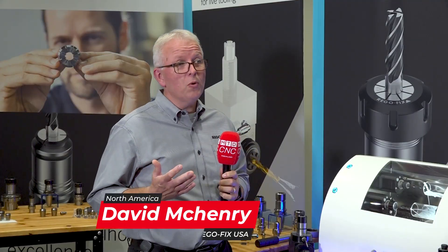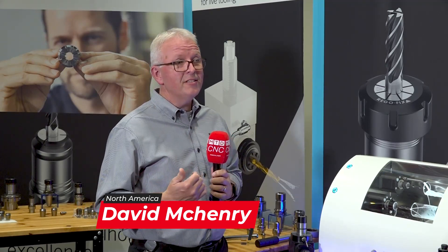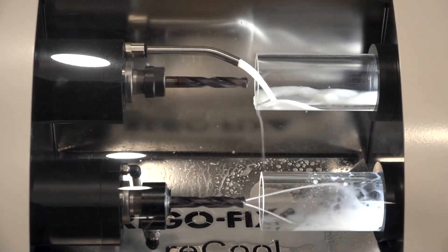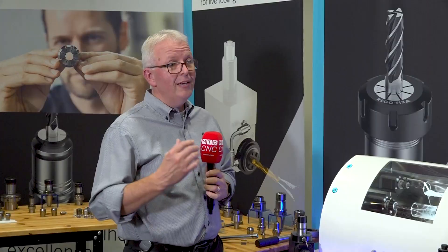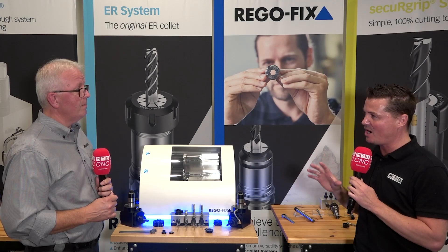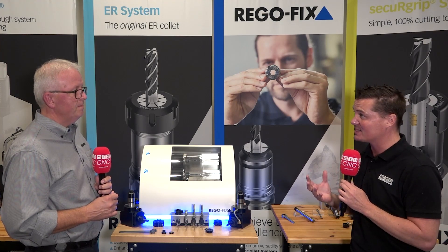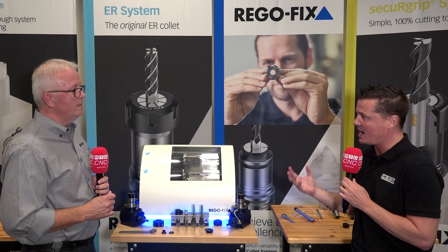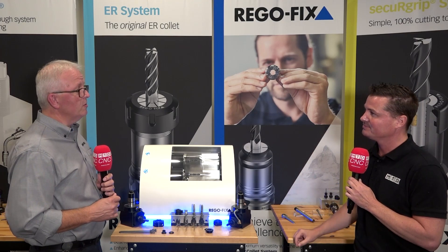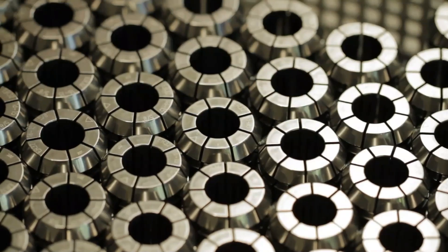To make a long story short, Recool is a coolant-induced nut. All we're doing is taking an external coolant supply and bringing it inside the nut to make your tooling assembly coolant through. The main items we're targeting are going to be lathe live heads, Swiss machines, ER11 up through ER40 sizes. So if you have a lathe, a Swiss lathe, or anything of those styles with an ER collet, this system can be adapted to allow through-tool coolant operations. It's as simple as taking off the regular ER nut and threading on the Recool nut, then connecting the hose assembly to get the coolant to go through it.